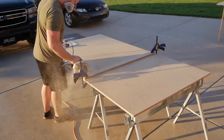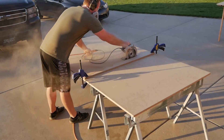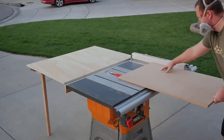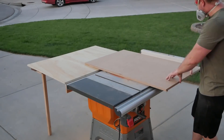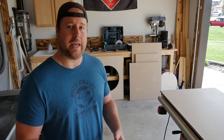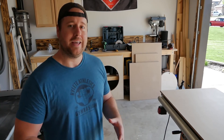The rest of the box was made out of MDF. To make it easier to handle on the table saw, I cut down the four by eight pieces closer to the size I needed with a circular saw, then cut them to the exact dimensions on the table saw. I've got the front baffle and all the sides cut. To make everything as square and flush as possible, I left some of the edges a little bit long, and as I piece this together, I'm going to be using a flush trim bit on the router and coming back and trimming everything flush.